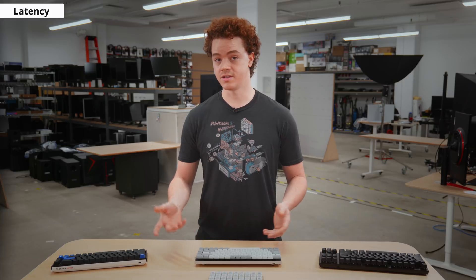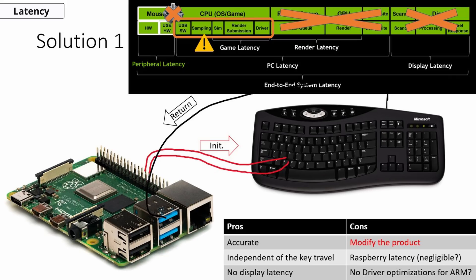As you can see, our test setup is quite complex, which seems unnecessary at first. We initially considered other approaches, but each had major downsides. One option was wiring a key switch directly to an Arduino: the Arduino sends a signal to the key switch completing the circuit to imitate a keypress, and the keyboard's output is connected back to the Arduino via USB so the keypress output is returned. The difference in time between sending and receiving would be the keyboard latency. This works well — it greatly reduces system latency and eliminates click latency — but it requires de-soldering each keyboard, and since we don't want to risk breaking the keyboards, we couldn't pursue this option.